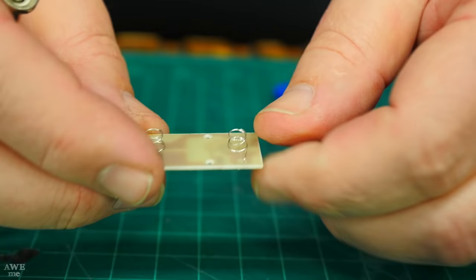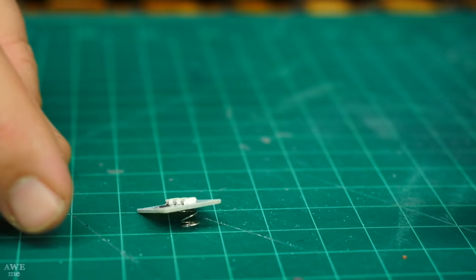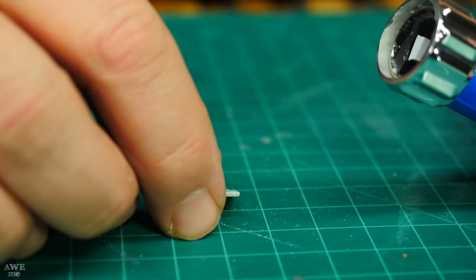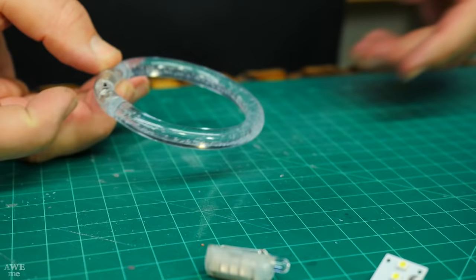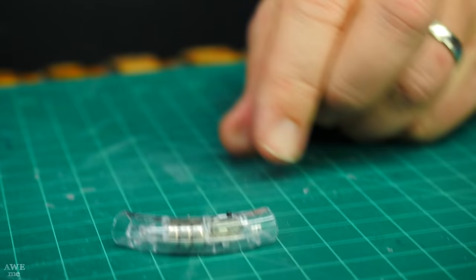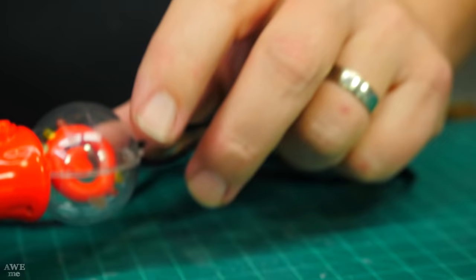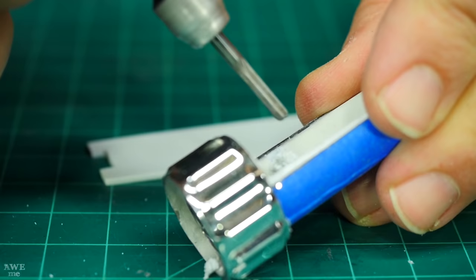All I want out of this is the LED — I don't care about the rest of the flashlight. The circuit board is so simple; basically all the parts I don't care about are on one side, so if I just cut it here I'll have my two leads that go to the three LEDs I do want. Because I cut all the electronics off the LED lights, I'm going to have to wire up my own switches. I can use the switch out of a light-up bracelet, which is nice and tiny, and then for the momentary switch I found one at Goodwill — that'll work fine.